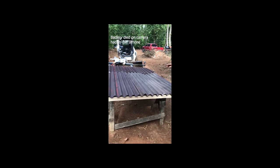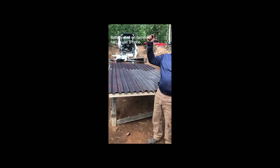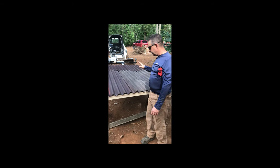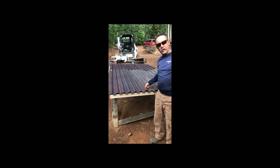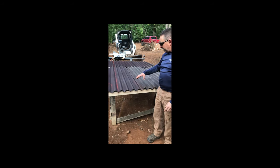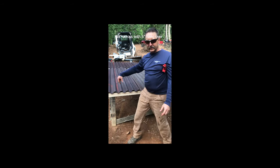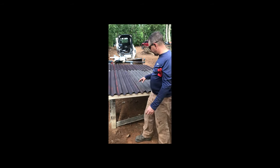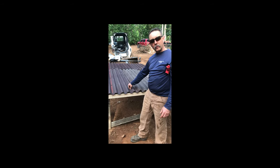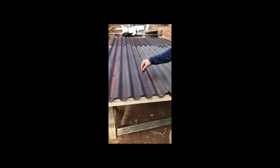Here's the roof. I'll put the material list down in the description so you guys know where it is. We went ahead and framed out for the roof so we could put it on top of our Privy, and it's 48 inches across with a 6-inch hangover on each side. Went ahead and used some screws with some rubber washers here so they run through.